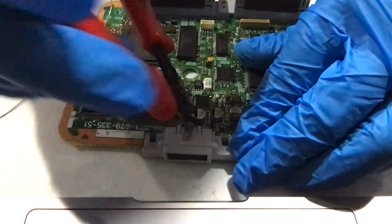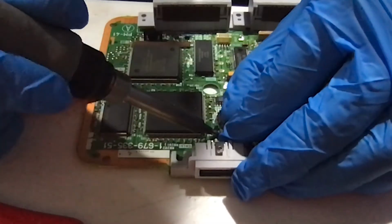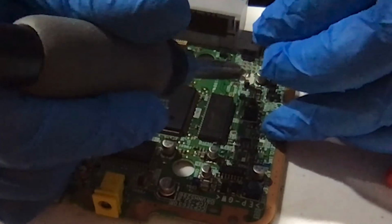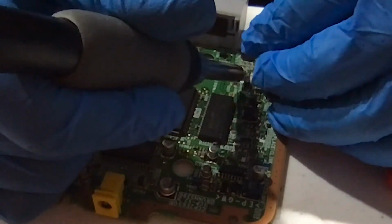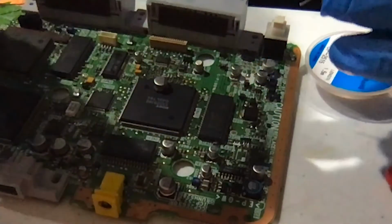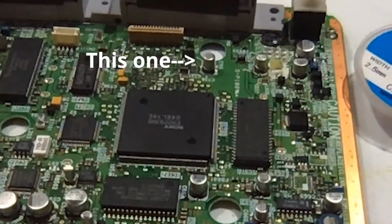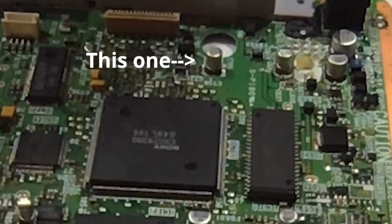To remove the capacitors, I just twisted them off. I started replacing a few caps, but then I thought I could just use my dad's multimeter to narrow down which capacitors are malfunctioning by measuring capacitance, using the functional board as a comparison. I found that this cap was faulty, and because I was so confident it wouldn't work, I didn't get the footage of me soldering it in.